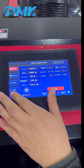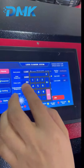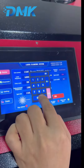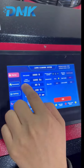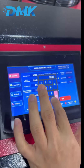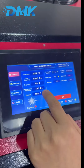On the touchscreen there are four parameters. You can see the laser power — you can touch it and input a number, like 3,000 watts. Here is the laser frequency — you can also change it, for example to 5,000 Hz. Here is the duty cycle where you can input a percentage.